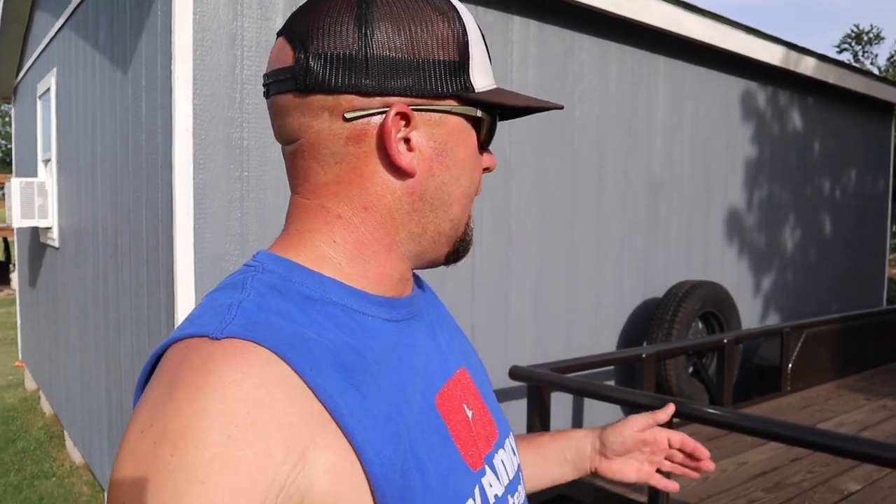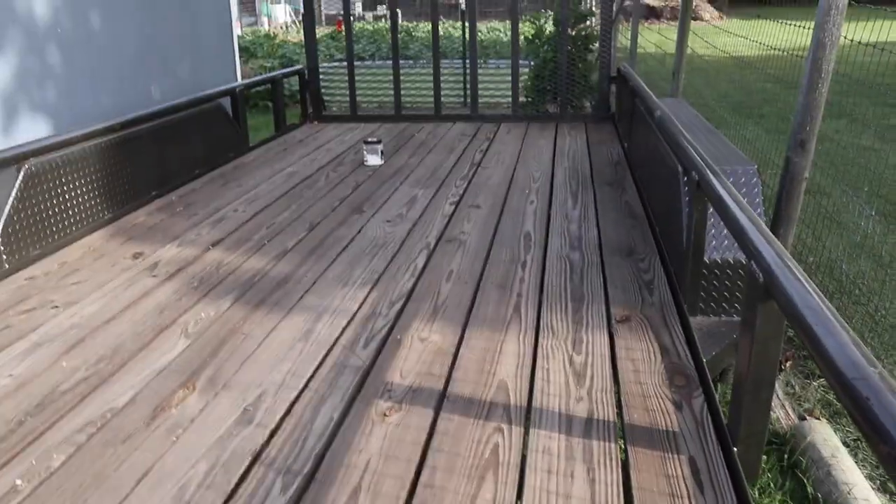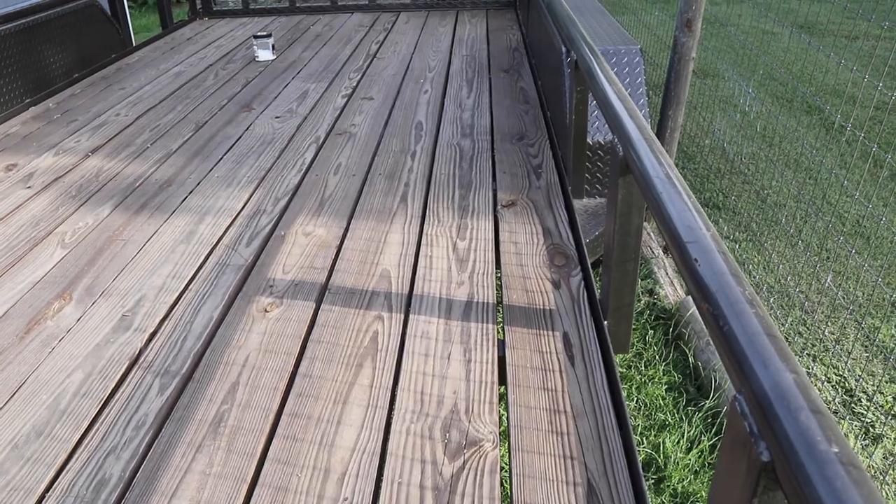I treated this trailer deck about a month or so back, and it's had plenty of time to absorb the oil. About two weeks ago we had a really heavy rain, and that water was just beading and pooling on there — none of it was absorbing into the wood at all. It's kind of lost the smell as well. On that video I mixed a jug of motor oil — about half full — with a full gallon of diesel to make it go farther and spread easier on the trailer deck. This time I just went with straight motor oil. If you have a lot of posts to do, you can definitely add some diesel to thin it out and make it go farther.